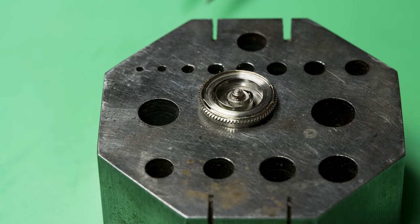Watch this — I turned that screw the wrong way. That is often the case: it's a reverse-threaded screw. That's another reason why you don't want to force things. If you're trying to be the torque monster and just screw it down, when you go to remove it you'd be turning the wrong direction and could strip the head right off. They use reverse-threaded screws on things that turn in the same direction that would otherwise undo the screw.